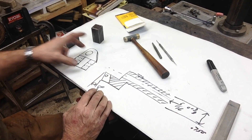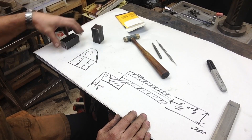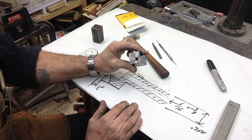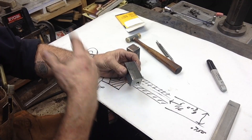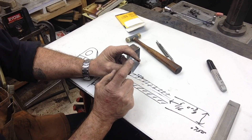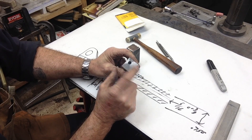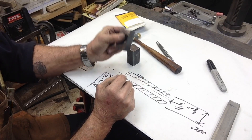This is kind of an end view and we'll show them as we progress. I've already done the first one — we've got our through hole. We're doing them for five-sixteenths holes, which is big enough for the smaller projects I've done. I've already taken the first block; what I did is take both blocks, set them up in the milling machine, squared off the ends, chucked them up in the four-jaw chuck, laid them out, drilled and reamed those to five-sixteenths, and then faced off the end.